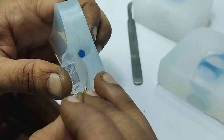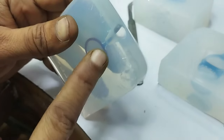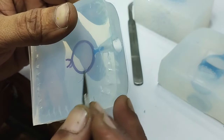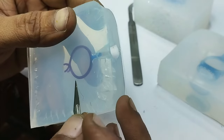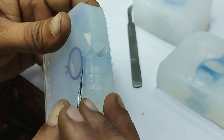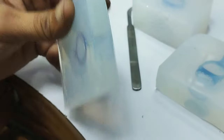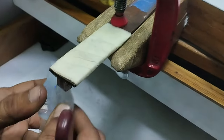And we have to cut along the master inside, the RPT we have. So we will be cutting onto the edge of the top part of the shank of this ring. We should not cut from the center of the shank because otherwise you will have a parting line. Now we will shift to the claw here, so it can help me to check it.